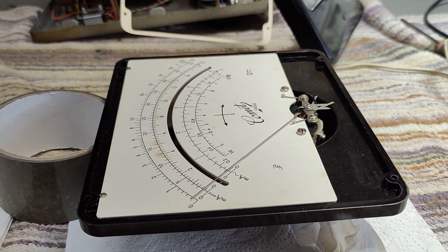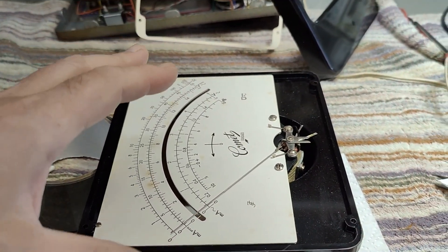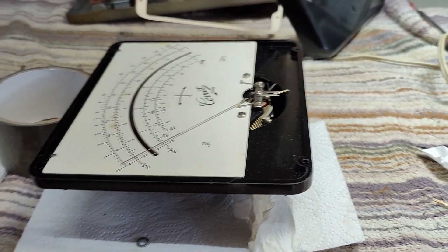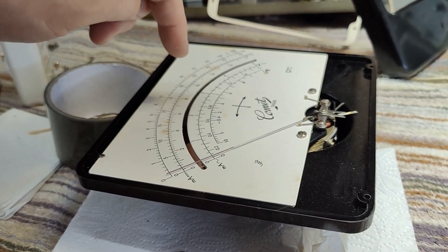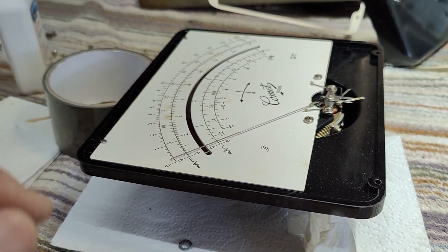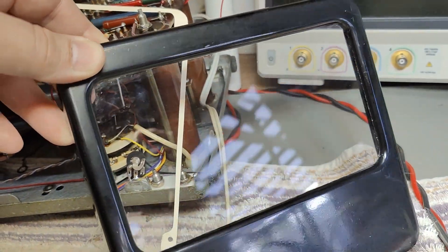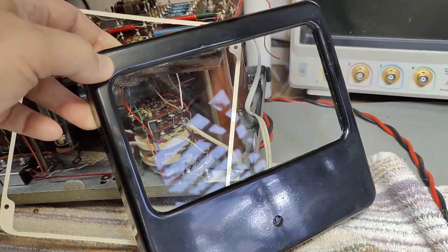Now I'm ready with the meter. There's one little thing I want to show you when repairing a meter with a broken or loose glass — it's going to go down and hit the needle and bend it a little bit. So when the meter is lying flat on a table like that, you just blow a little bit on the needle. This way you will see that it's moving freely. After you've checked the needle is now straight and free, when it stands up it's never going to touch anything.